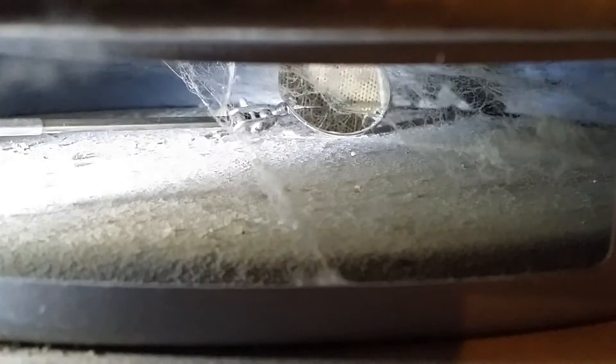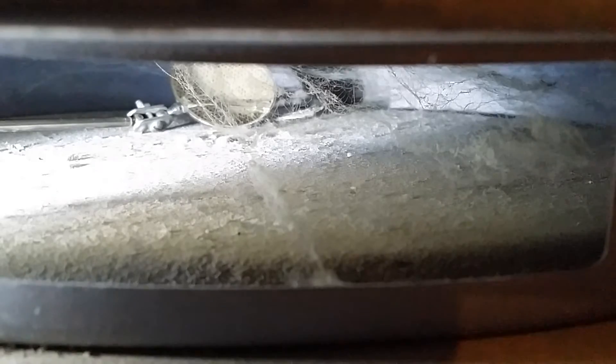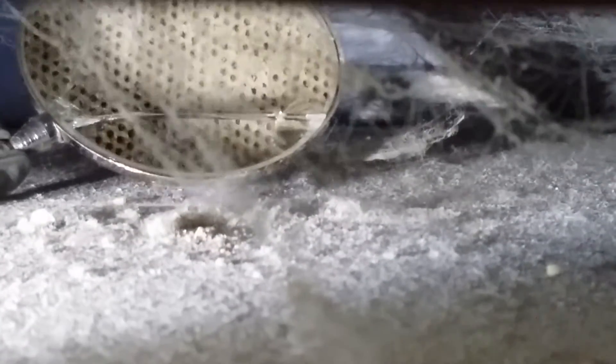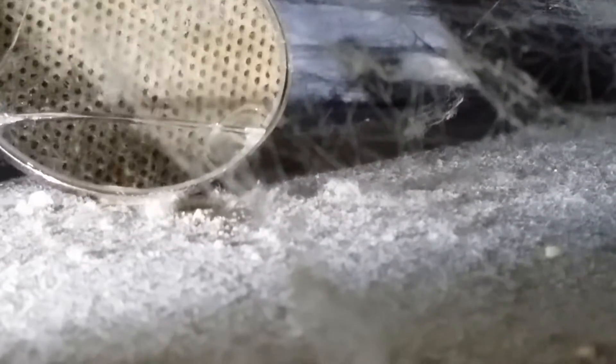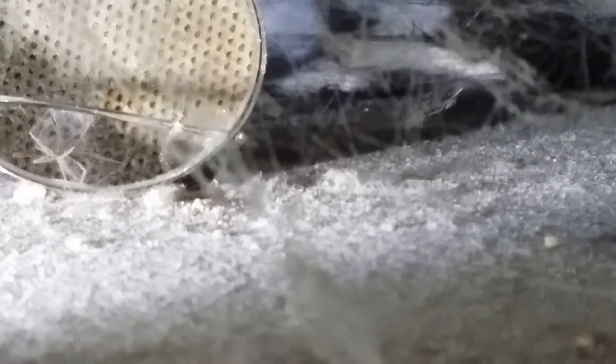You can see up here in the mirror the honeycomb shapes. You can see how dirty it is up there as well — that's where all of the combustion air goes to get underneath the burner. This is a common cause for problems with the pilot going out continually. When these little holes up there start getting plugged up, the air cannot get through for proper combustion and your pilot light tends to go out frequently.